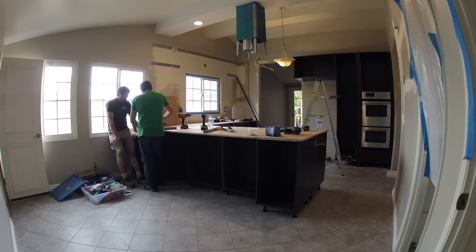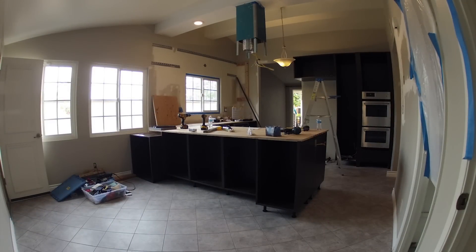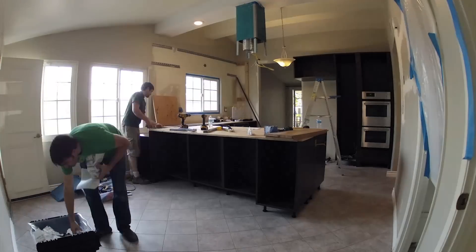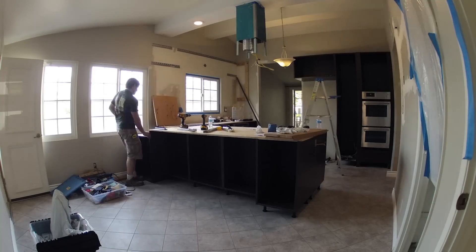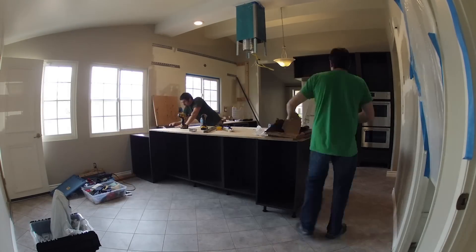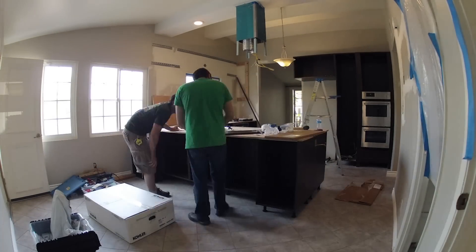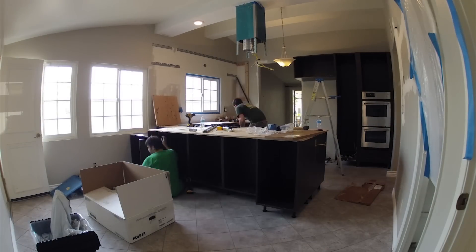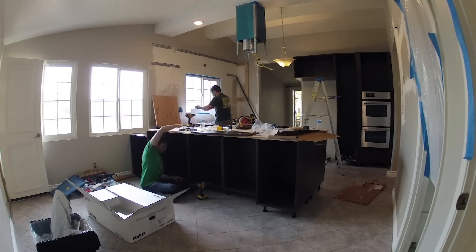Here we're making decisions on how to frame this area out. We need to support the edge of this overhang bar — there's a 9-inch overhang so we're going to build some pieces to support that. We're also figuring out where we need finished edges using this cabinet material versus where there's going to be granite countertop tiles or edge tiles. I'm putting together some of the cabinet shelves and doors to make sure we maintain clearance so all the doors will always be able to open and won't have any close calls with the countertop above.